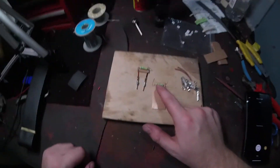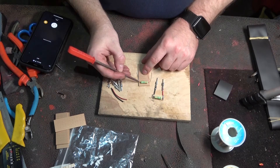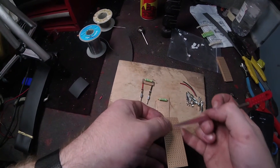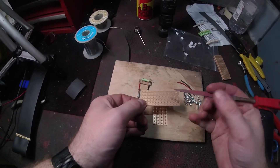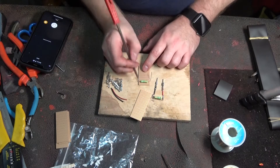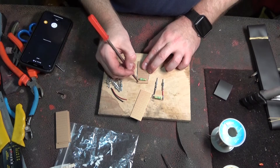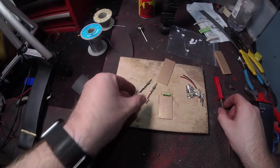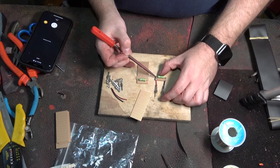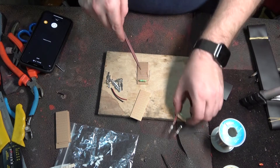So I've got that in there now. I'm going to pull the legs back. We'll be soldering here and here on the board, because as you can see the board traces are running parallel to each other. If I put it that way, the power is not going width ways — it's going length ways up the board, hence the lines. So I need to solder that leg there and solder that leg there. Our pins coming out will be here and here, like this one. You can see that's soldered — it's straight through there, comes up here, through the resistor, up here, through that one. That's exactly what we need to do with this one.